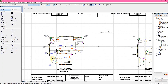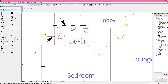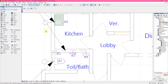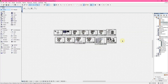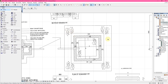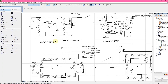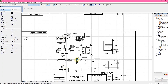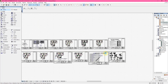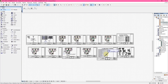Then there is the upper floor plan of the water supply and sewage. In the upper floor plan of the mechanical drawing for water supply, you can see it just shows pipes — indicating that water is coming from below going upward. Finally, there are detailed drawings of the house components: the soakaway detail showing the plan and section of the soakaway pit, the septic tank detail, and other details.